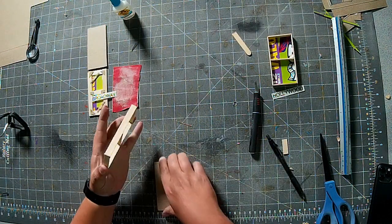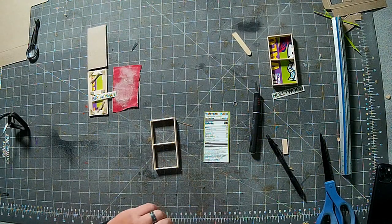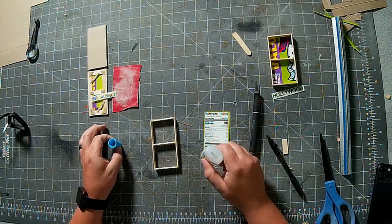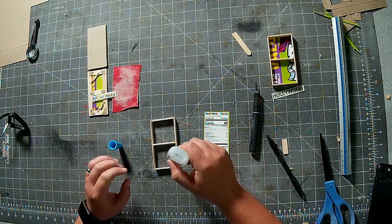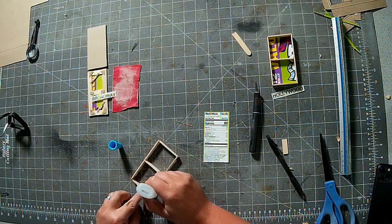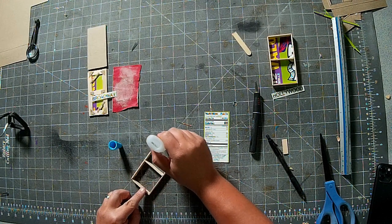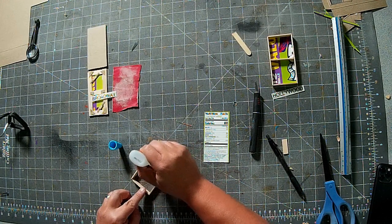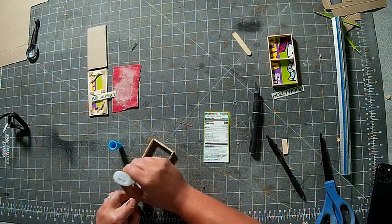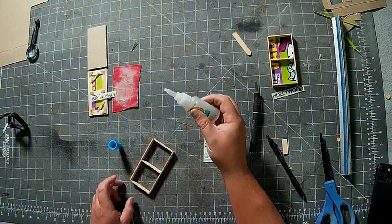All right, our flat is dry. Now we're going to glue it to our covering. If this were muslin or fabric, again, you would wrap it around your flat and glue it to the edge. You would also add some staples. Again, if you're using dimensional lumber like plywood, you would also add staples to the top and add some glue to hold it in place.